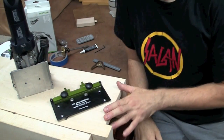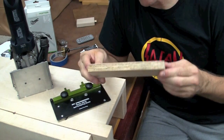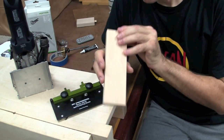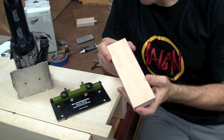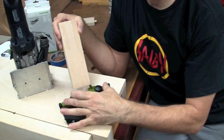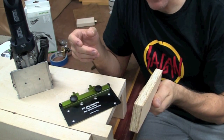For doing this calibration, you're going to need a small block of wood. I used a piece of exotic wafer board — I set it to 60 millimeters wide, just an arbitrary size. I don't want it too narrow because I want to register off this end, but not so wide that it's on the outer edges of the guide. I just picked 60 millimeters as a convenient size. I used wafer board because that's what I had in my scrap bin.